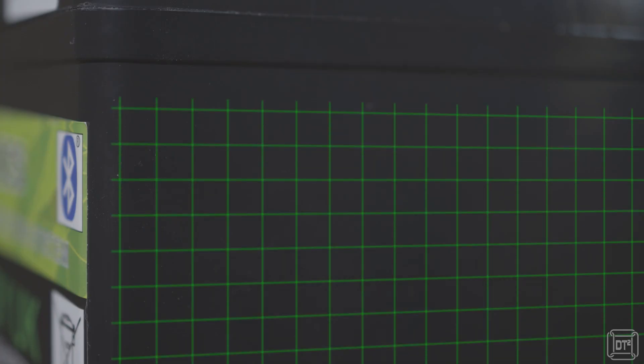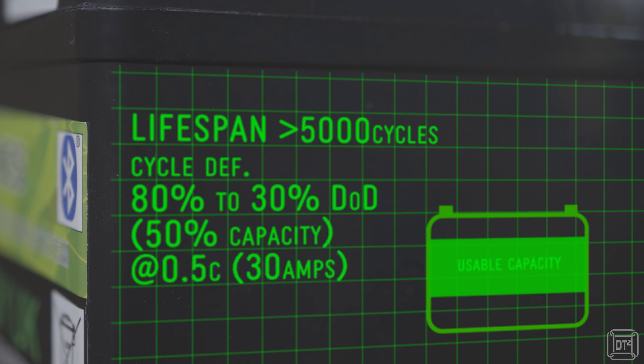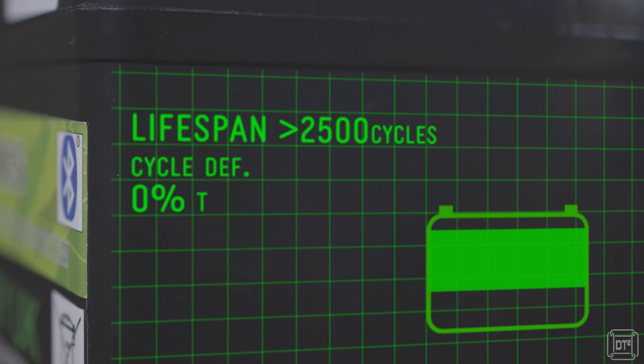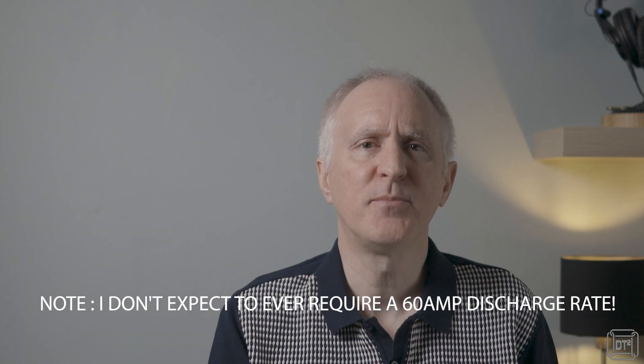The stated lifespan for this battery is over 5000 cycles, but that's only if charged up to 80% and only discharged to 30% at a rate of 30 amps — so 0.5C. I think it's unrealistic for me to assume that I'm always going to stay within those discharge numbers, so when considering this battery I actually looked at the worst case estimates, which is a constant 95% depth of discharge. This much harsher treatment gives a lifespan of two and a half thousand cycles. To put that in perspective, if this battery is fully discharged and recharged every day at that rate then it should last almost seven years, so I fully expect it to be working for as long as I'm caravanning and probably have a decent resale value in the meantime.